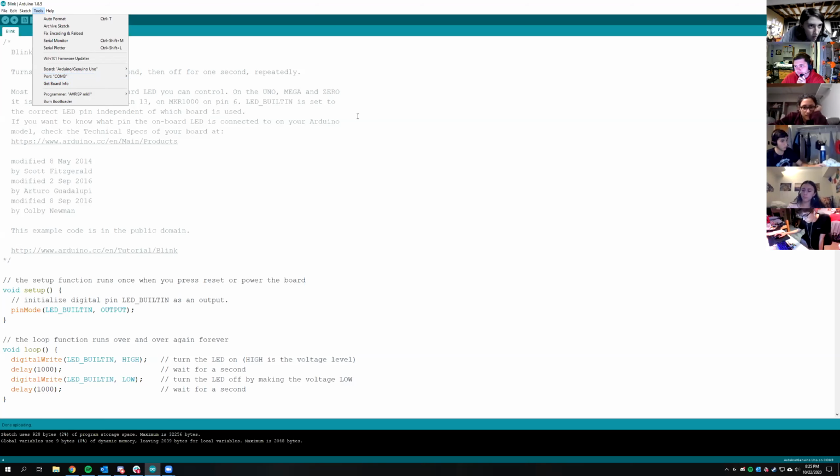First thing that I want to ask, if you hit the reset button, which is the push button that you soldered on, does that blink the LED at all? Yes. Okay, that's a good thing. That means the bootloader's on there. What are your highest COM ports? Mine was 4.